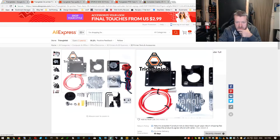But while this was happening, I spent a while trying to figure out why it was clogging — it seemed to be working again and then not very quickly after. The CR-10, which is behind the black curtain, started having issues. The thermistor went first, so basically it wouldn't print because it couldn't tell if it was getting hot or not. So I was thinking about replacing the Bowden style on that with a direct drive, and I decided this was the time to do it.